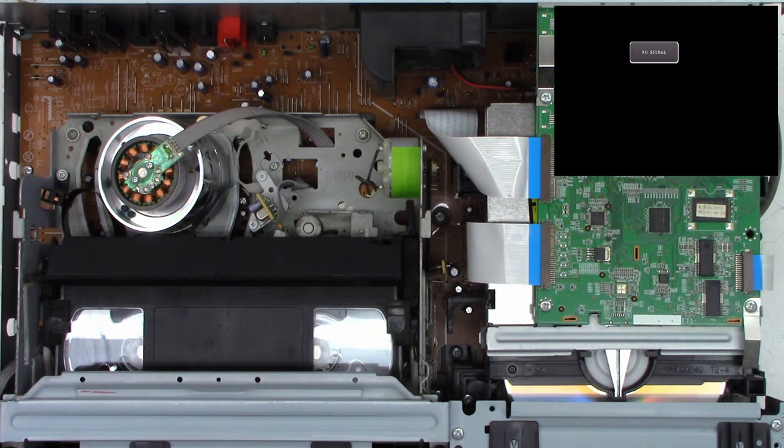I see 0.37, I'm perfectly fine with that. This is a 10 at 16, and I see 1.7, 1.8, I'm okay with that. This is the main filter cap right here, and I'm going to check the pad first to make sure there's no connection, because I have unsoldered one lead of the capacitor. And I do see 0.02, 0.03. It actually tests good. I'm still going to change it to be safe. Once again, checking the pad first, and capacitor value of 0.6 ohms on a 10 at 50. That is actually really good.